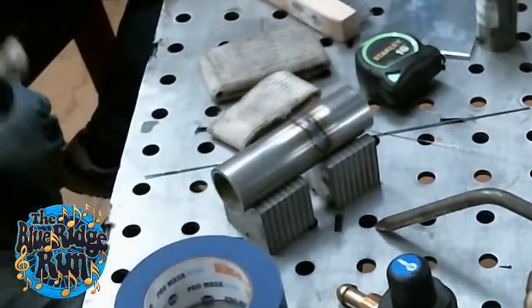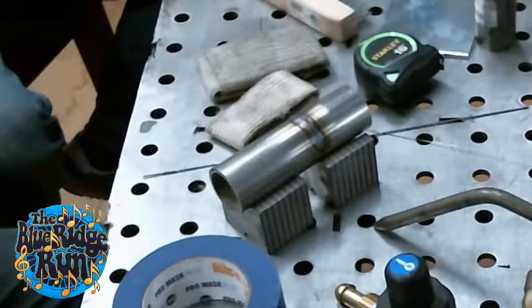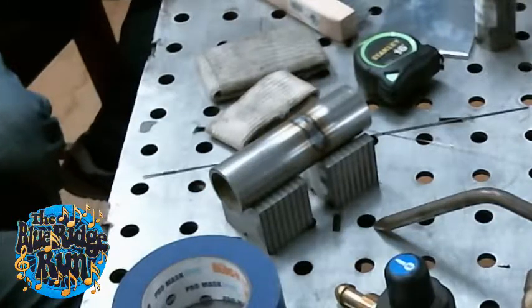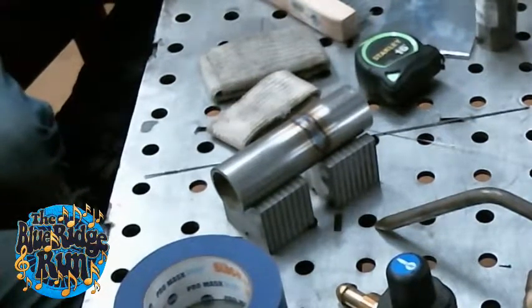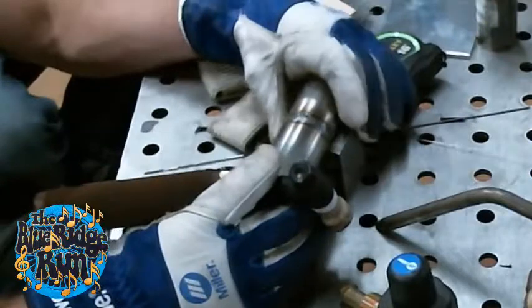And it all depends on how well it's tapered or beveled, I guess, because the material is gonna fill in better. Is there an actual taper dimension you go for, for pipe fitters, I'm saying? In general, when you guys work, is there something you shoot for? In fabrication, blueprints will have a degree of the bevel called to specs, which will get inspected, but on stuff like this, it's not as critical.